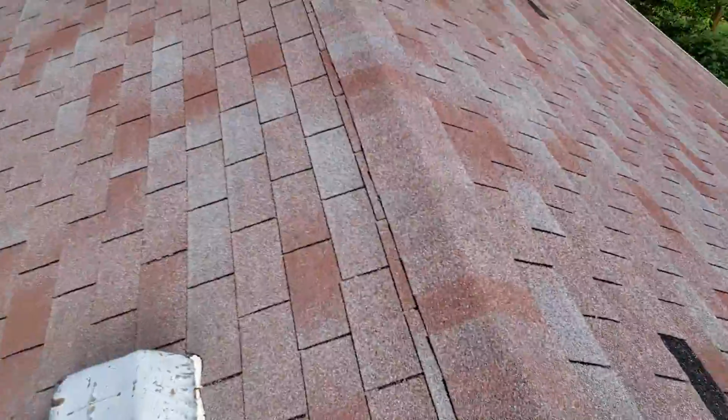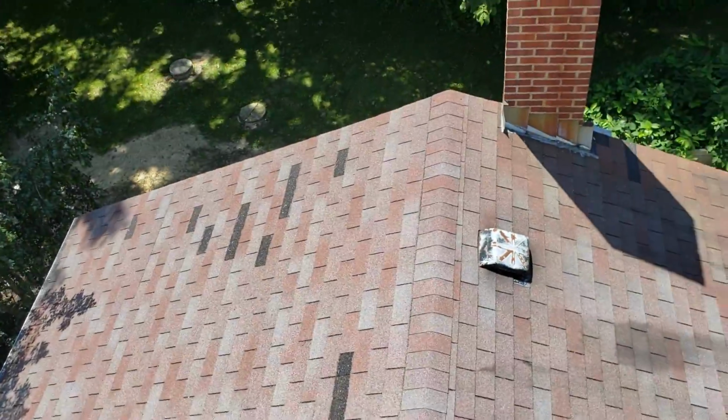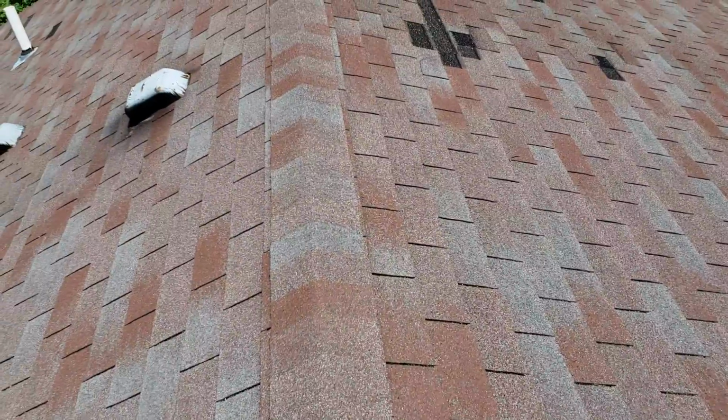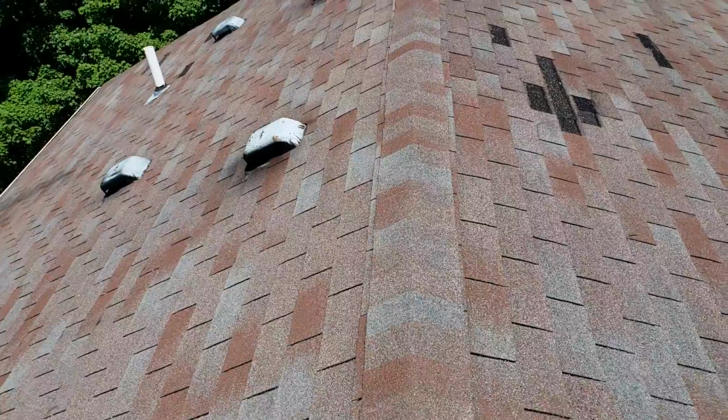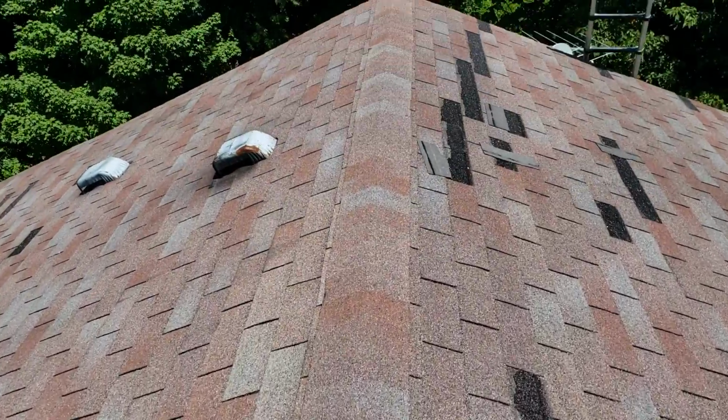What I'd like to do is get rid of these box vents and cut in end-to-end shingle over ridge vent. Snow country ridge vent through GAF really lets these roofs breathe really well. That's imperative. It's going to let your next roof last a lot longer, and also for the warranty, you've got to ventilate your house to get qualified for that.